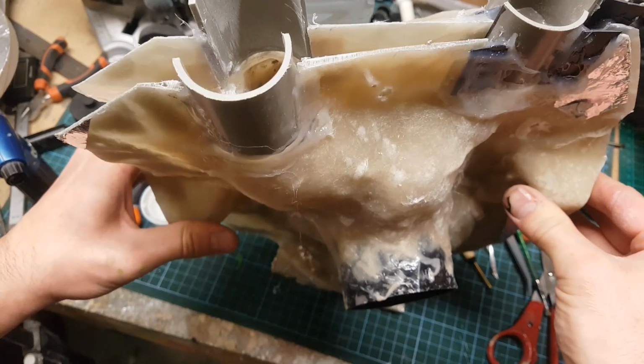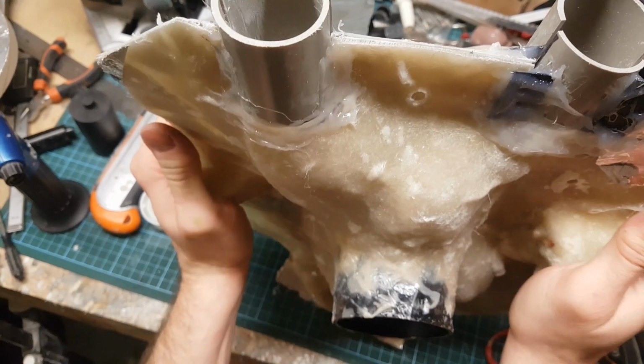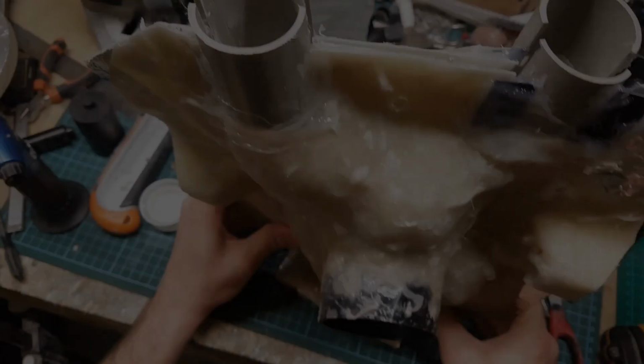They're the two high points of the sculpture, so it made logical sense that that's where the resin should go. So I started thinking, okay, well, if I create some pouring spouts attached to each of the ears, I can have a plug that goes where the 15mm pipe would be and pour the resin in from the top instead. Obviously you might get some trapped air in the head, for example, but I figured if I just rotate the mould as I'm pouring, all that sort of stuff, I should be able to free that air. So that's the approach I've gone for here.